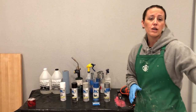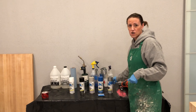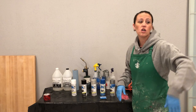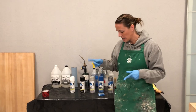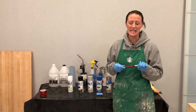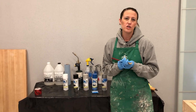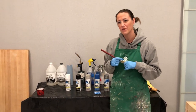Once Cory's finished mixing, we'll pour our clear coat on and then pour some epoxy into our little clear cups. We'll spray our paint in there, mix those, then pour these colors onto the clear once it's troweled and chopped, then start manipulating it. For chop brushes, we love the shorter brushes. We go through a lot of brushes, so we use ones from Home Depot — they're an inch and a half. If you de-shed them for a while, make sure they're nice and de-shed, you don't usually have a lot of bristle breakage.